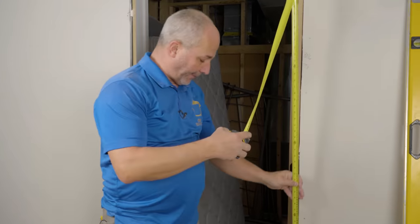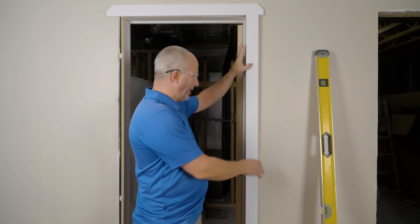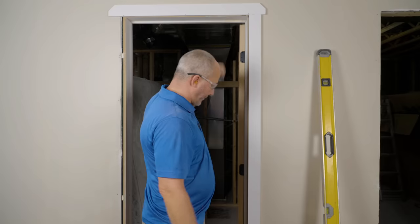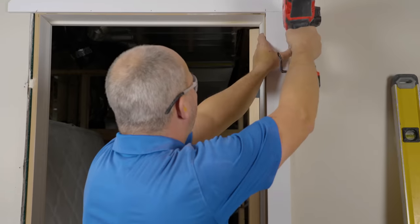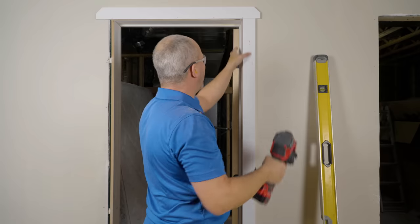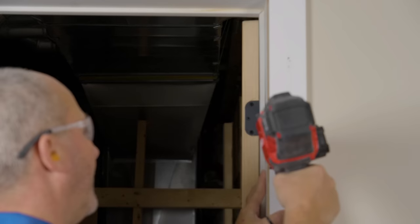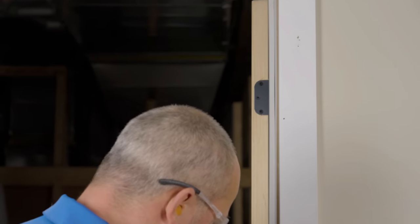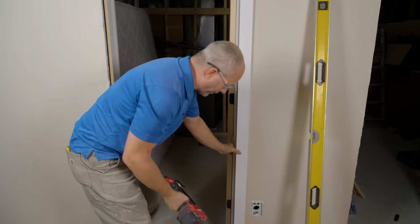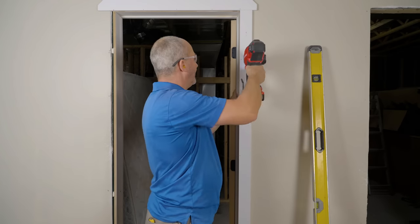Next thing is the casing. Now we're going to measure from the floor right up to that lead edge and be as precise as we can — 79 and five eighths. Let's cut that one down. When you cut something perfect, it won't fit. Now that's perfect. We're going to use a two-inch nail on the outside of this material to contact with the stud. When you're putting on your casing, you can't just rely on nails on the outside — you've got to put some into the jam itself. So use the inch and a quarter up against the jam piece. That'll make sure the caulking doesn't get separated over time. When the doors are opening and closing, if things cause some twisting motion, that'll save your bacon.